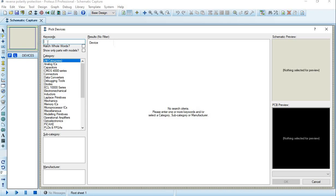So what do I do here? I now select a transistor. Let's say you are designing a circuit that is going to be pulling like 50 amps of current. Your best bet might be to use an IRF3205. But you know that once current starts flowing, there will be heat dissipation. To save your circuit and the load, you put transistors in parallel, so you can increase their current rating. For this demo circuit, I'll be using an IRF3205.